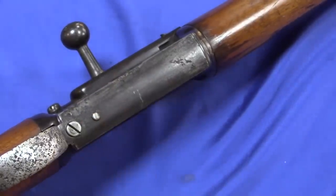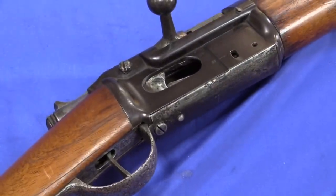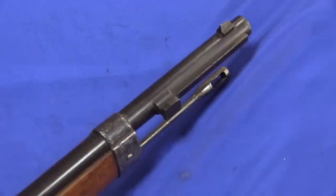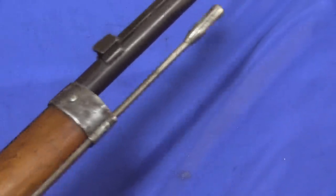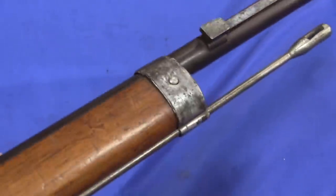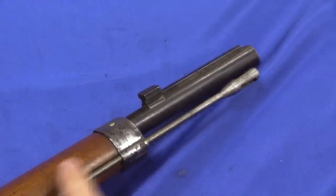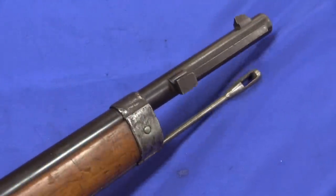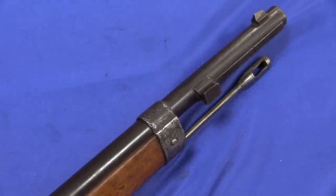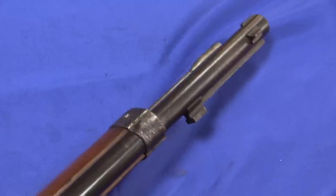We have a floor plate here that would allow access to some of those parts. But again, this rifle hasn't been restored, and I don't want to be the guy who tries to take that screw out and discovers it's just going to shear off. The muzzle end of the rifle is very much like the standard French military pattern. However, it has a clearing rod on the bottom — typically that was not done on the French tube-fed guns because there's a magazine tube in the way. In this case the designer mounted the rod all the way basically below the stock instead of in the stock. Where the French Kropatscheks have rods on the side, this one has it on the bottom. We still have a standard bayonet lug, which presumably fits a Gras bayonet.